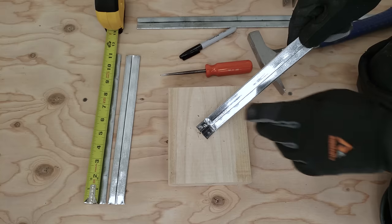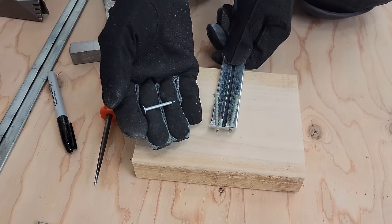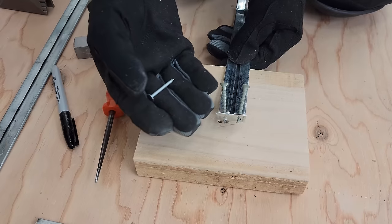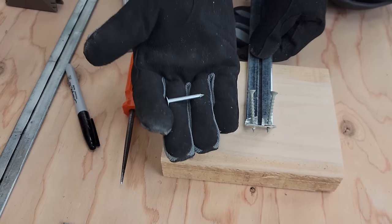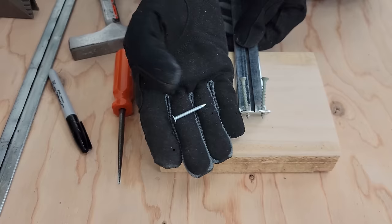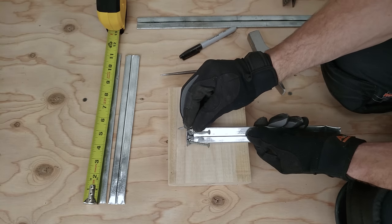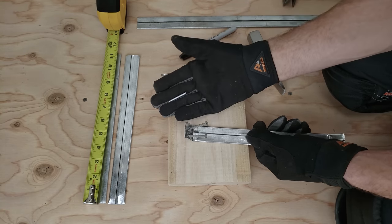And we're gonna be using deck screws for this in order to mount them into the joists. I use 2 galvanized deck screws because I know they're not gonna rot over time and they're not gonna fall out. I've seen enough ducts actually fallen down, the whole entire duct falling down just because there's one roofing nail that was nailed through the bottom of this into the floor joist, and that's just pulled down over time due to that wet crawl space.